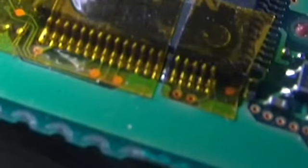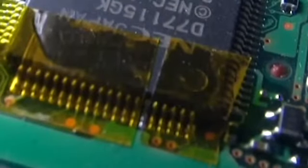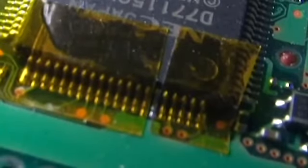I was recently asked what's an easy way to solder down small wires to very fine pitch surface mount parts. When the pins are very small, sometimes I'll use a piece of Kapton — it's Kapton spelled with a K — tape to mask off everything except for the single pin that I want to solder to.